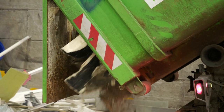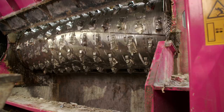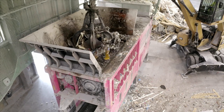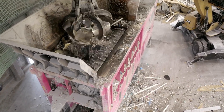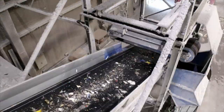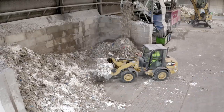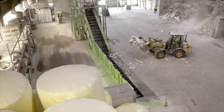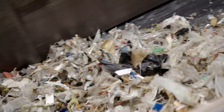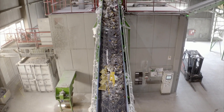Glass fibre has been around in industry since 1935; recycling only for a few years. But meanwhile the method has been refined, and it looks like this. The materials are mixed with waste paper residues and go into a kind of meat grinder. A large roller grinds everything to about 30 centimetres — but that's not enough. We need it much smaller so that the glass fibres can be properly utilized. Only when everything is small enough can the chips crystallize into cement. For this we need powerful helpers: huge iron chains. And they are at the heart of the plant — the cross-flow shredder.